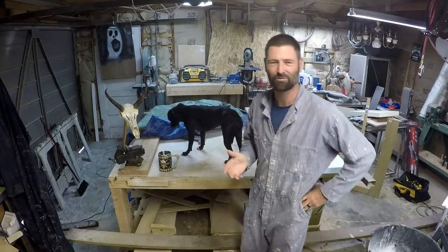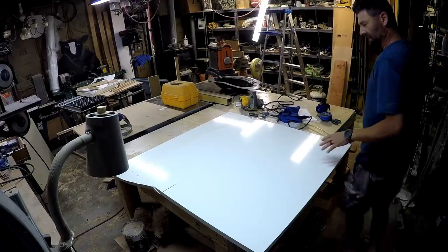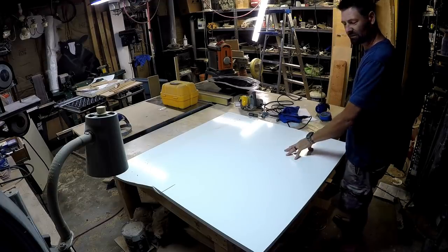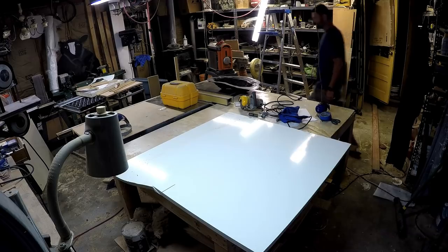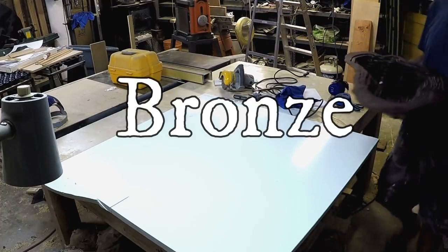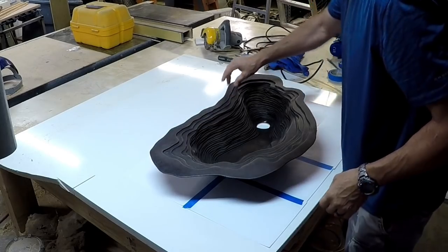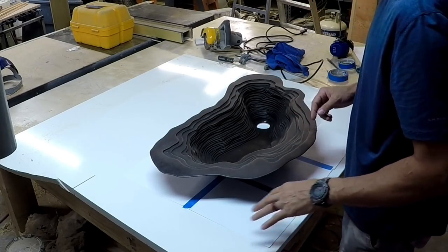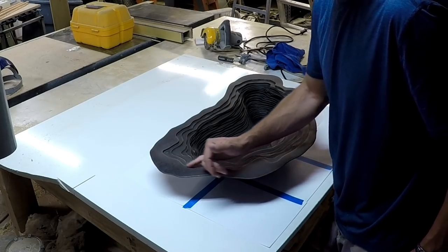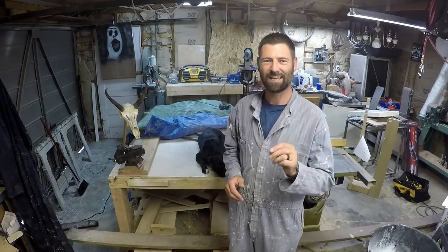Has anybody watched the Patreon-only video I just uploaded two days ago? The next phase of this bathroom remodel is to take this slab of quartz, cut it down to a 36-inch vanity top, and undermount this cast brass sink underneath it. First I have to make a template — the top is going to be cut so that it's mostly flush with this line here.